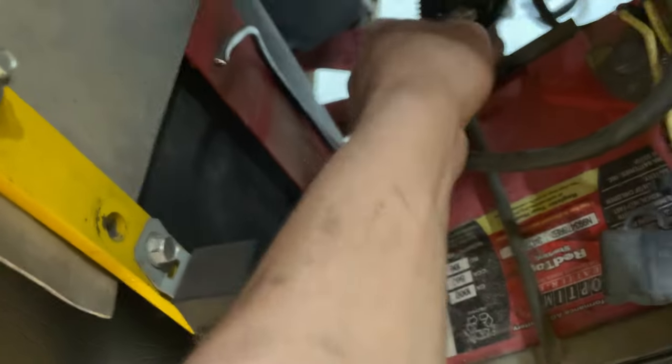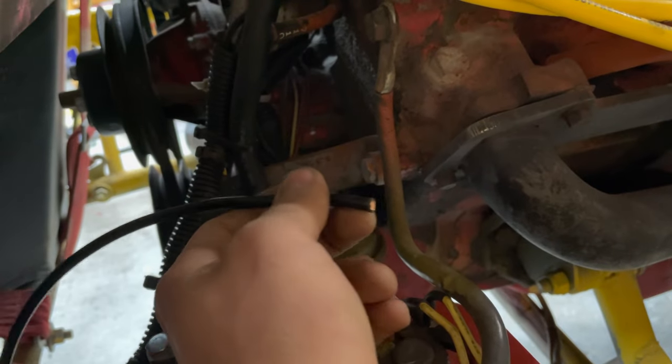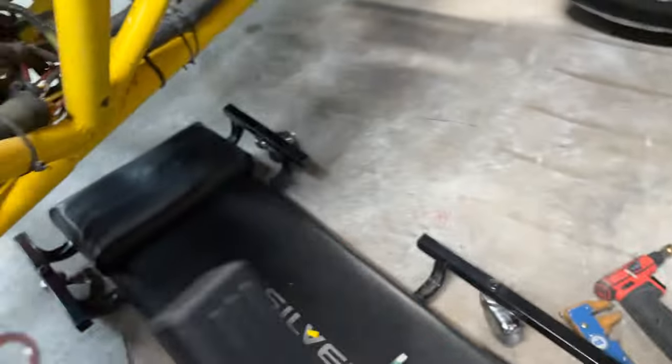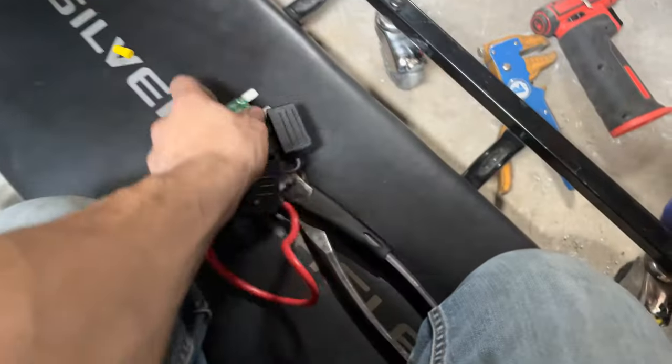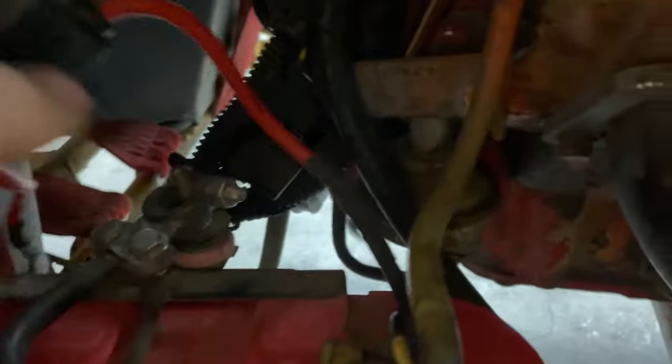Here I've got my main power wire. Yes, I know it's black — I didn't have any red wire so I have to go black with my power wire. This is my inline fuse. I'm just going to cut that wire right there, splice it into this wire, and right there I'll plug in my 30 amp fuse. The inline fuse is all wired in, ready to go. It's on the positive of the battery and running down to the module there under the seat.